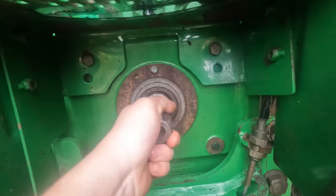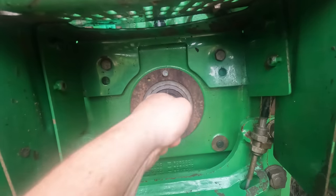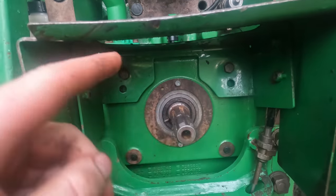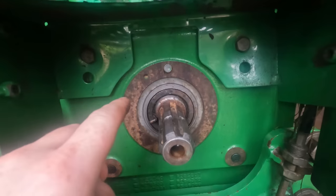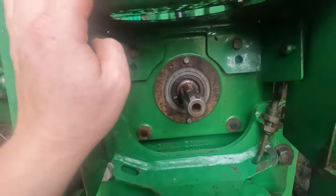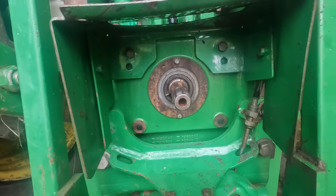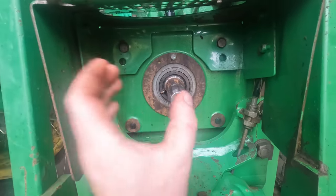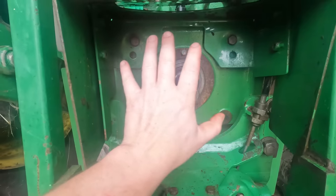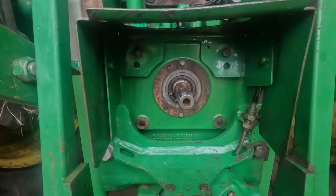Yeah, see there it goes quiet, and then if you go to about there's a roughness. Now, there's a bridge in the back of there, you'll see when we take it off, but the pins that locate that into the whole entire back casting are, well, I've been told that they are like glass, in that any sort of unusual strain on this, and those will shear, and the whole lot in there will move because it holds all the gears in.